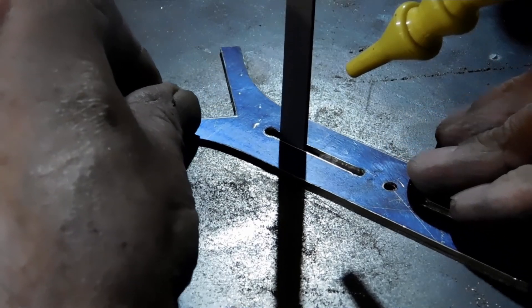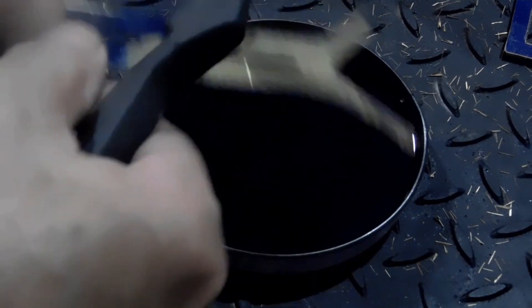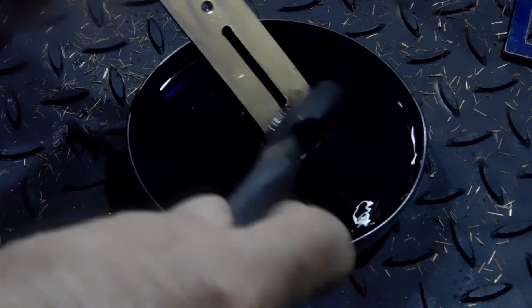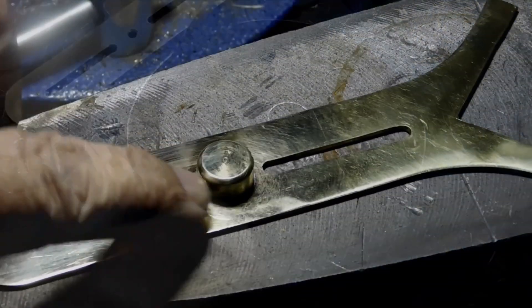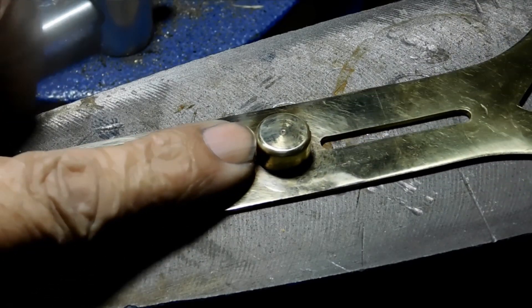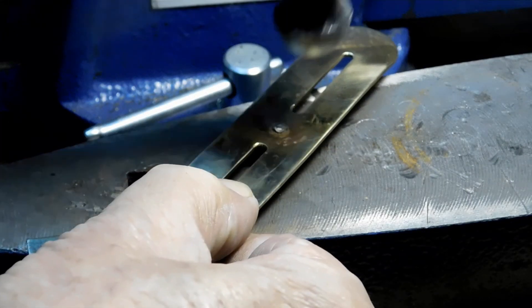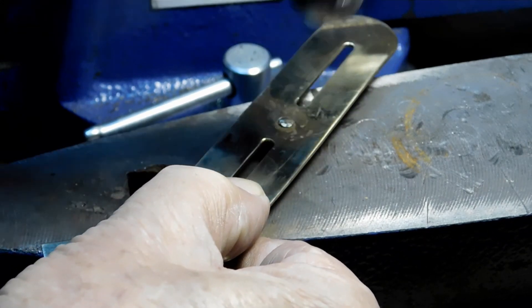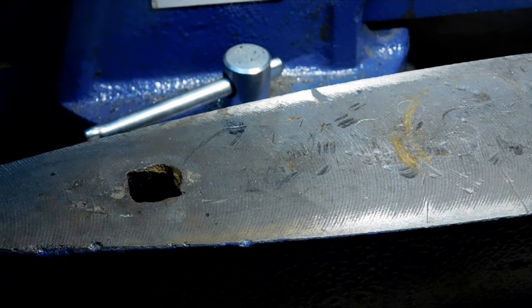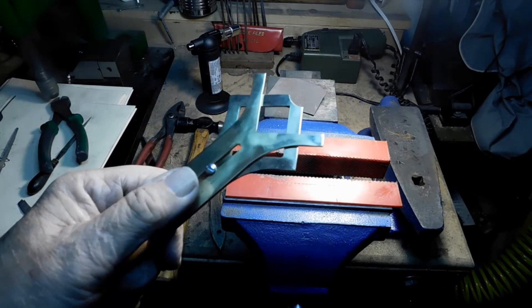Just want to finish it off enough so there's not a lot of draw filing necessary. Now we're taking the die off and getting a look at what we've got. I made that button on the lathe and that helps you push the top one through a hole. I put a little 45-degree chamfer into the hole in the back, and now we're riveting it on the back with the ball peen hammer. Once I'm done riveting I'll sand it clear — that works pretty good; that's going to be just fine.